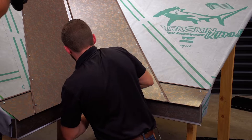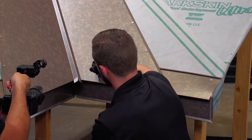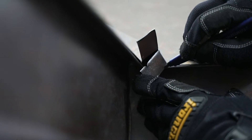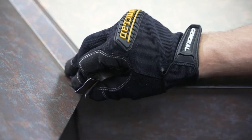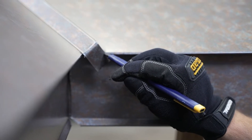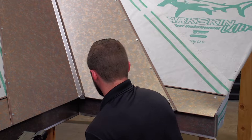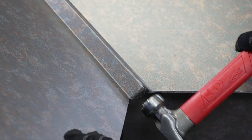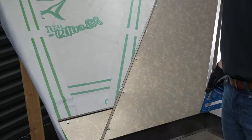From there, take your snips and go right up the high of the valley. We're going to fold the first one under — make a rough mark, cover the bottom, snip it right across. Take the next one, fold that down, start with the square cut. Fold that down and square cut this one straight up to close off the end of the panel. Everything is finished down on the W part of the valley — all closed off.